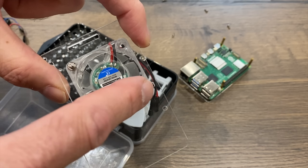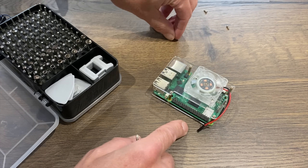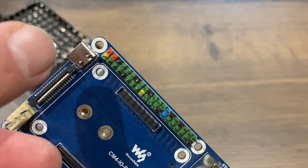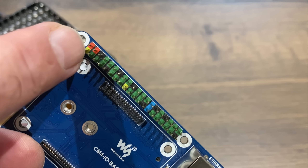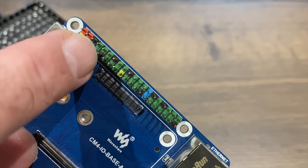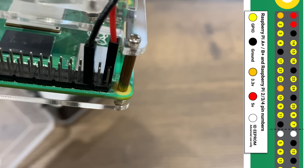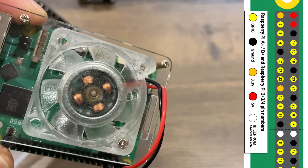I prefer fans with separate pins. This is a 52pi fan and it's going to make some difference until I've got a better solution. It's definitely worth having one of these screwdriver kits if you work with a Pi. This case still has access to the GPIO pins which I like, and I often use the Waveshare board with colored GPIO pins — yellow is 3V, the two reds are 5V, and black is negative. So that would be the 3V configuration for this fan.